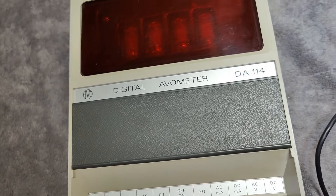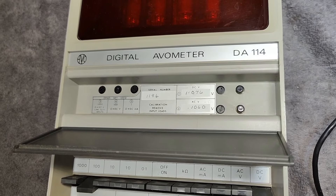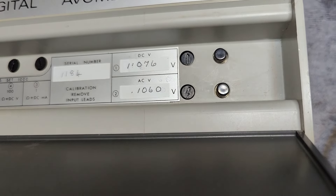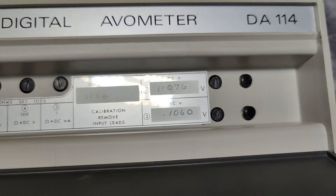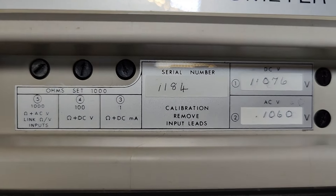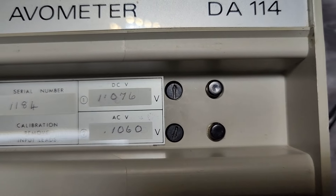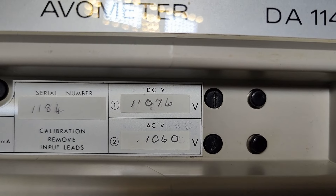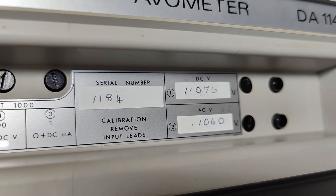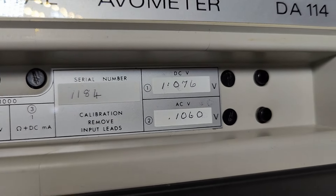There's another little thing about this unit - you can open this one. And here you go, your calibrations. So there isn't any reason to open it; you simply adjust here on the front. It's a little bit weird. Here's what you do: you remove the leads, then you push this button and adjust this potentiometer for this voltage. But that is what you do, and then it will be all right.